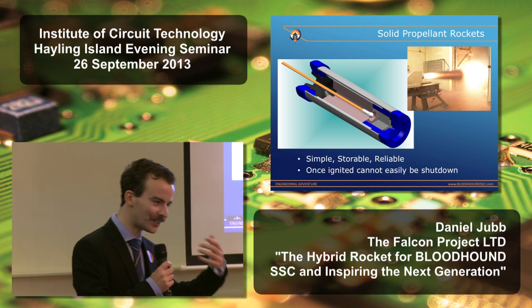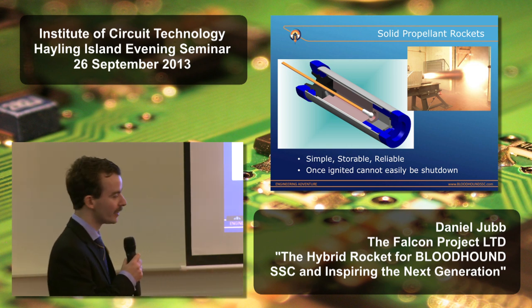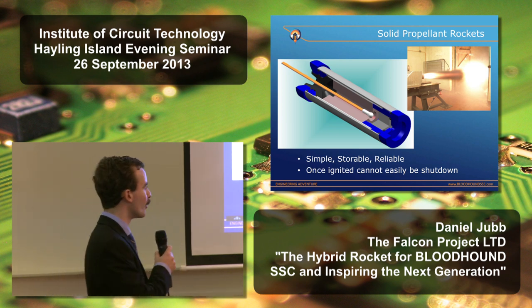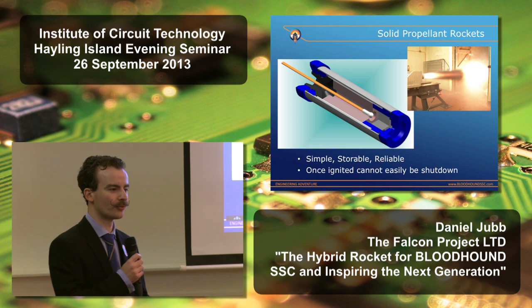Now, obviously, the technology's advanced from gunpowder in fireworks to advanced composite propellants, things that you'd find in the space shuttle solid rocket boosters, for instance, where instead of using potassium nitrate as the oxidizer, you're using things like ammonium perchlorate, and fuels such as aluminium powders and rubbers. But being unable to shut it down is the key problem for a land speed record car.